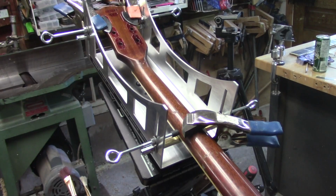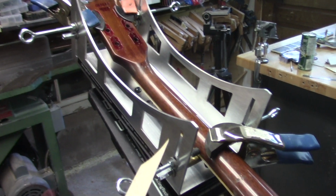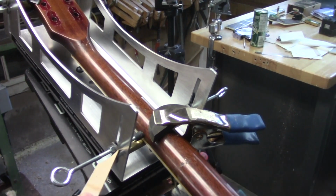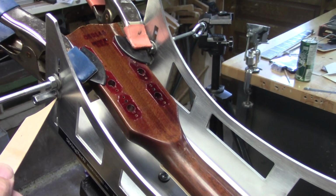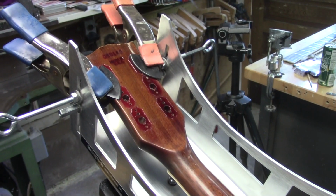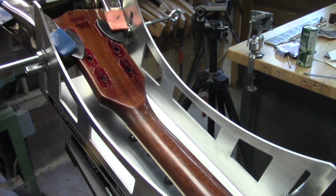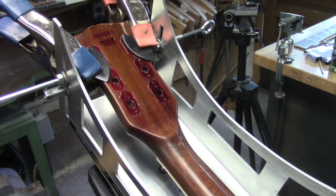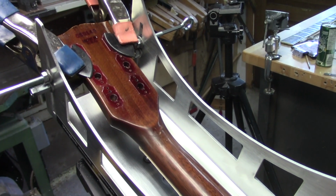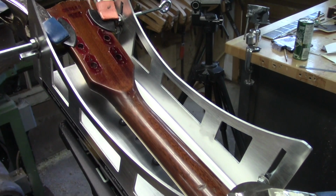you'll see. So when you get your kits, once you set up that first time, this stringer here basically never moves. You just leave it right where it is. The stringer on this end will allow you to sort of alter the depth of cut. Once you get it set up that first time for the Gibson headstock tilt, you're pretty well good to go. Take all the time you need to get it set up and have the guitar firmly clamped in place. At that point, the easiest part of the job is to make the cut.